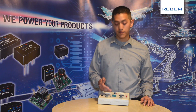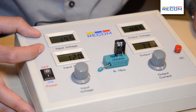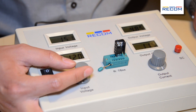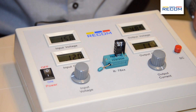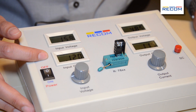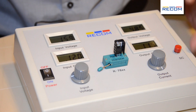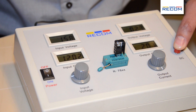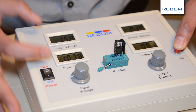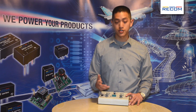So here we have a linear regulator. Input voltage is 12 volts. If you increase the voltage, the current will stay the same. So you have the increased power coming in, but you have the same amount of power going out. So efficiency will go down. Also, it doesn't have short circuit protection. So if you short circuit it, the input power remains the same and the short circuit will draw more power. And therefore, the linear regulator is going to burn up and eventually it's going to die.